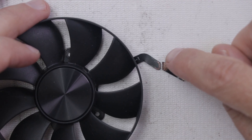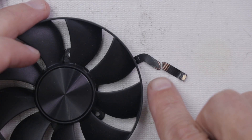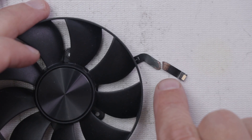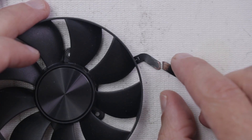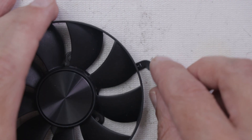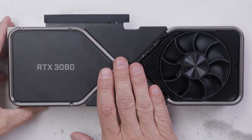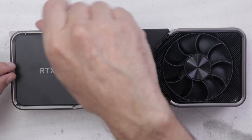Right here you can see the problem we're having. This ribbon cable was just torn right off right here. Richard has already sanded off the masking over these traces, so what we need to do is try and connect each one of these little circuits. But before we do that, I told Richard I would go ahead and replace the thermal pads while I was doing this, so let's get this torn down.